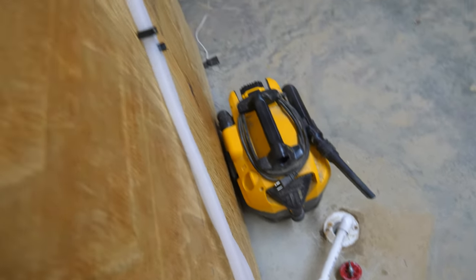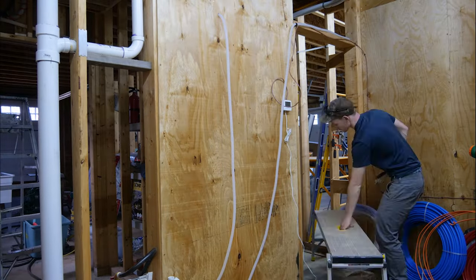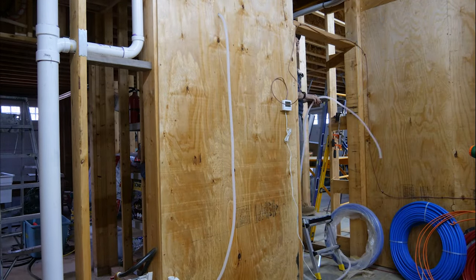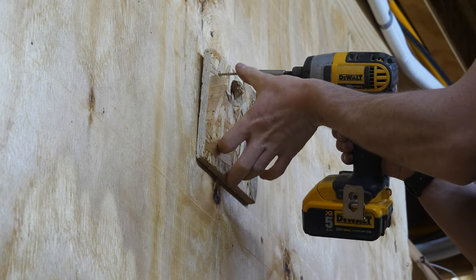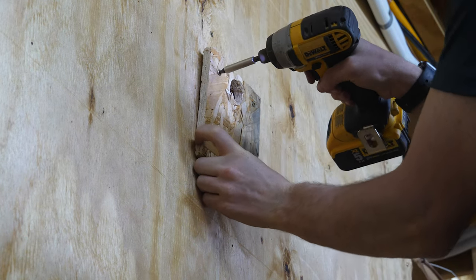The system is draining but it's not ideal. If you're going straight outside through an outdoor wall this flex hose is totally fine, but for my situation the PVC will do a lot better. Here's a trick for enlarging an already existing hole with a hole saw — just cut yourself a little guide so the hole saw can be piloted from the outside rather than the center bit.